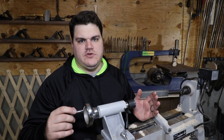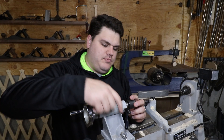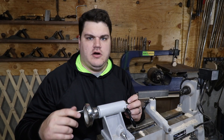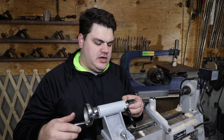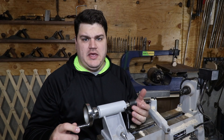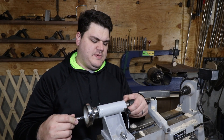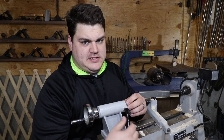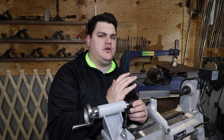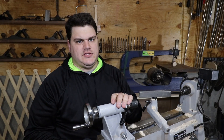As you can see, I was having trouble with my tailstock. The pin that locks it down was actually out too far before I locked it down, which caused the shaft of the tailstock to spin in place. Without this pin in its groove, the shaft spins freely. Even if I tighten this down after, it'll lock the shaft, but I haven't gotten enough pressure on the workpiece. Let's get back to it.